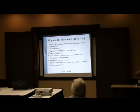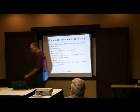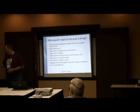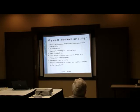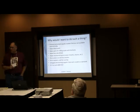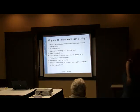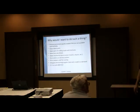You can print masters used for casting. So I told you that this telephone booth is a solid resin casting done from a 3D printed master. Well, here is that master right here. I'm going to pass this around and start on this side this time, just to be fair. That was the 3D printed master, which was then sealed in paint because the nylon material was printed and it's porous. And then I asked Martin, who's out in the hall there, and is a member of our local group down in the Washington, D.C. area, to cast those for me. And as castings, they came out beautifully. In fact, I'll start the casting around for the other side of the room. As castings, they came out beautifully, and they're very economical as castings.